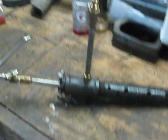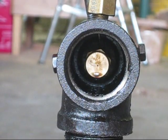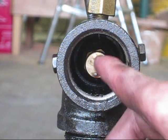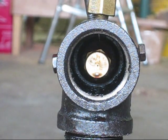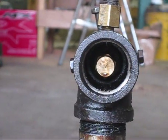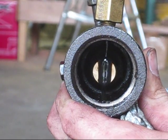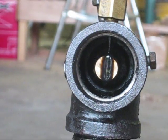That is the assembled waste oil burner. Now we need to go through some setup and how this thing actually fires. For setting up your oil stream, if you can see the hole right there in the center, that's what you're aiming for. You can see my little piece of wire up in there, directly over the reducer. You're going to have your oil hooked up — I'll show you my oil setup; it's nothing but a propane tank that's been slightly modified. Turn it on and you can see the oil goes right over the hole, and that's exactly what you want.